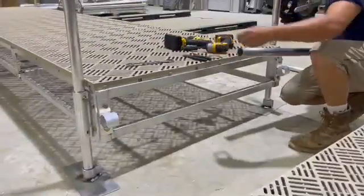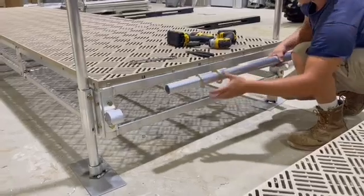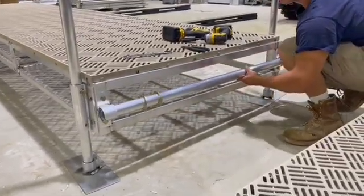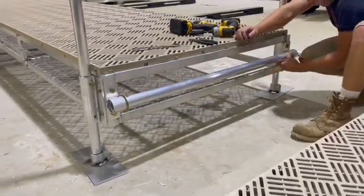After you've drilled out the dock pipe, you're going to want to slide both washers onto the dock pipe and slide it back through the brackets, with the washers being installed as furthest out as you can go.